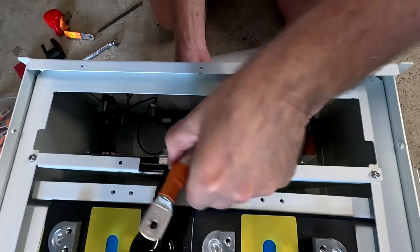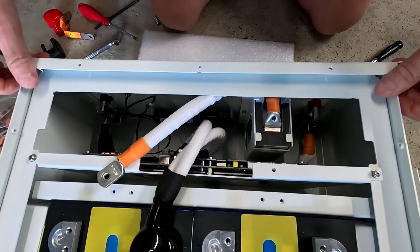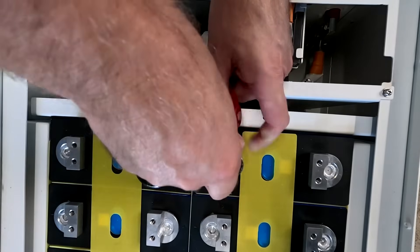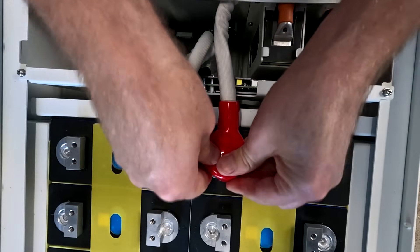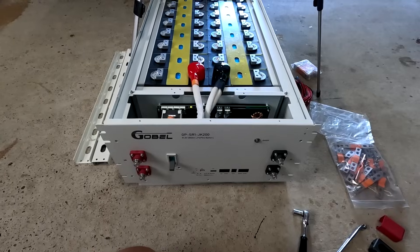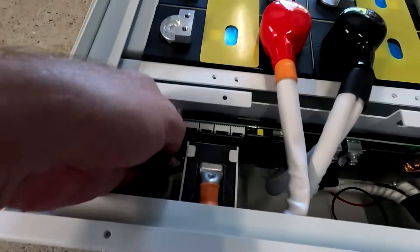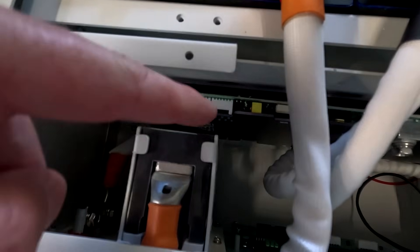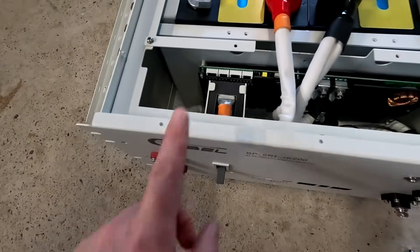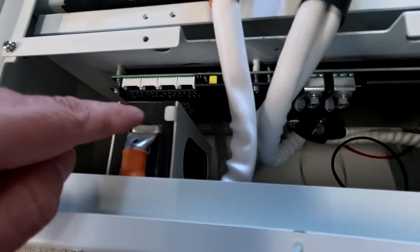Yes, it fits. Positive here — just two screws in the front for the moment so you can see if it actually fits. You can put this cover over the terminal, and then later on pull this one over the whole terminal — it covers it up perfectly. I like this. I think this basically concludes the mounting of the front panel, the BMS. Holy shit — we still have access to the communication cables which are at the bottom of the BMS. I think we can just barely reach them. Maybe I take off the front panel again. I've forgotten about these cables. I'll try to get them in without disassembling the front panel again, but you really should connect them before you mount the front panel.